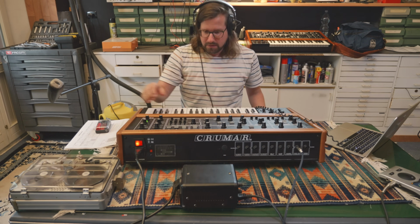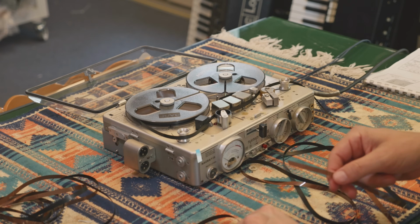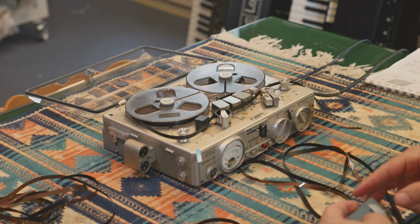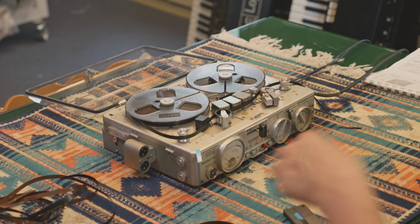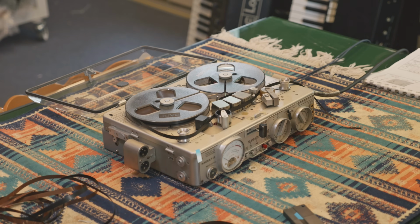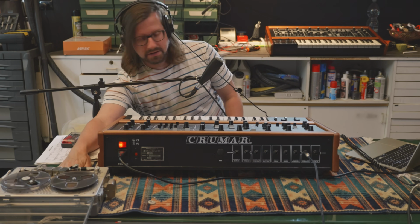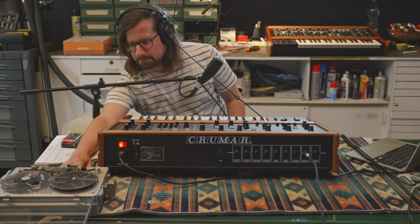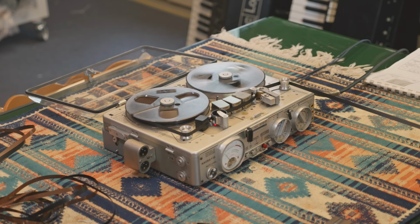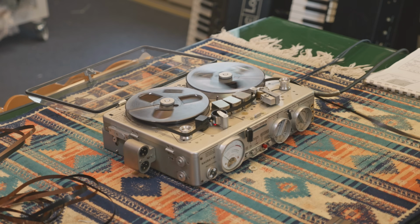Starting from the fact of creating an instrument identical to the original, I started from the service manual easily available on the net. Unfortunately, it is not complete, with some details missing, perhaps an error made on purpose by Crumar to avoid a copy of this instrument by competitors, I suppose. I had to scan all PCBs of the original Spirit and draw the tracks to have exactly the same schematic as in history. This last operation required considerable time, but in the end we got an exact copy of the original instrument.